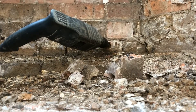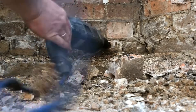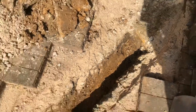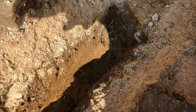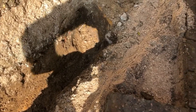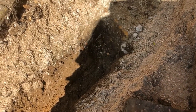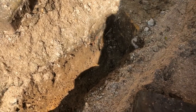So this just popped through — it felt like it popped through right at the end. I'm going to go outside and see if we can see it. Good news: you can see the drill bit there, it is at the edge of the trench. But it's come all the way through the foundations — through the wall, through the foundations, and there it is. The only disadvantage is that it's taken an entire metre bit to get through. If I'm going to get a duct through the other way, I'm going to have to use an extension or a diamond hole saw, and I hope I can line it up from both sides.